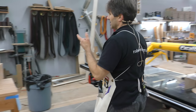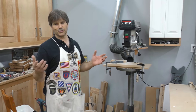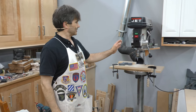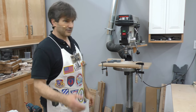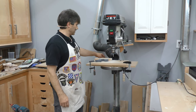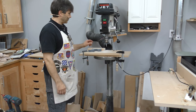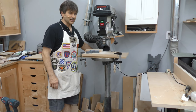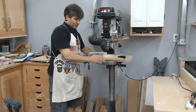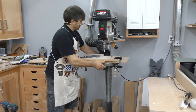Number three tool is the drill press — you're going to want a drill press. So many operations in woodworking require drilling and this gets used a ton in our shop. In fact I've got 18 of them, but you need a drill press. I would make sure you had one with an adjustable table. You just loosen it and you've got to catch it as it falls, but having an adjustable table is a big deal. Always keep it tight — as it tightens it rights itself, because in the relaxed position the table drops so it's no longer square to the spindle. Tighten it and it pulls that up.